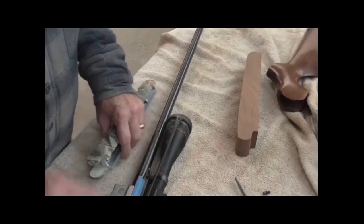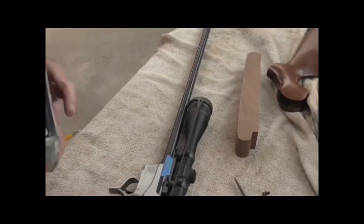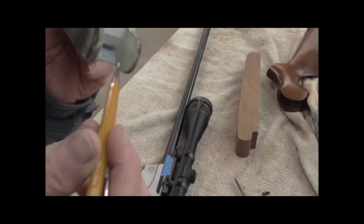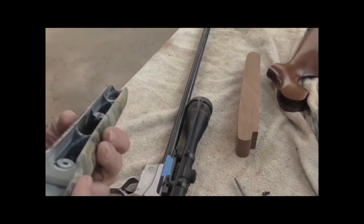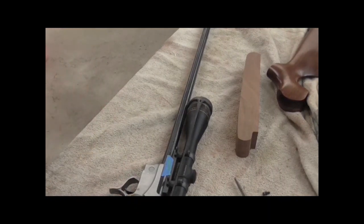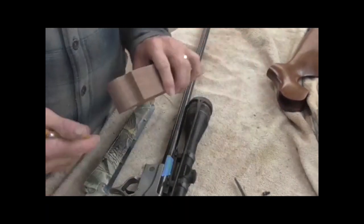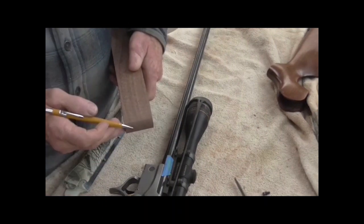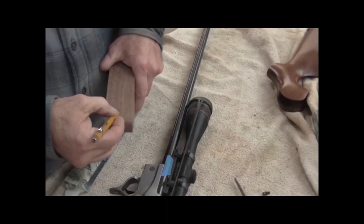The way this thing tips, there's a square corner right there, that's on about a 40-degree angle or so. There's a notch back in here, right in there. And really, I don't know of a decent way to mill that. Of course, this is just a piece of plastic. They can form it however they want to, but I got to mill it into wood. So what I'm going to do is start with a slot right here with a flat bottom, and it stops right along in here.